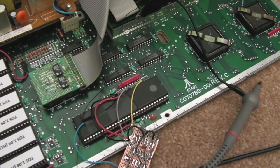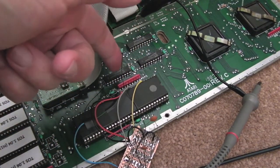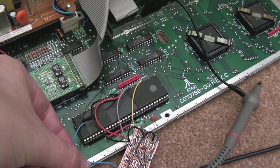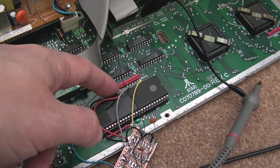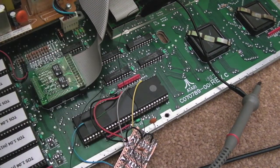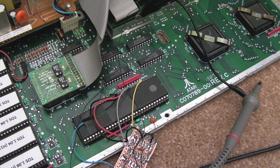Like I say, I've done quite a bit here. Yeah, I mean, the 16 megahertz wire there is pretty long, it's pretty thin. Is it that? Is it length? You know, I was looking at the shots you've got of your breadboard there, and again I've got 8 megahertz coming from the board there. I've checked that, that's a suitable replacement that goes to the input here. It's definitely short. And there's nothing wrong with the pinouts and stuff. Definitely used the right chips. I've used all 74F chips.